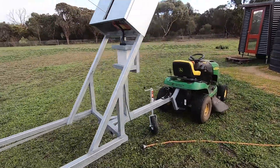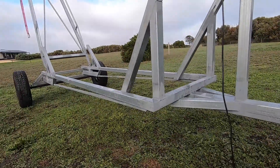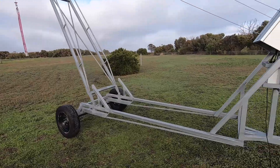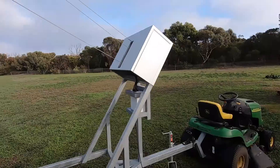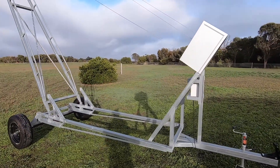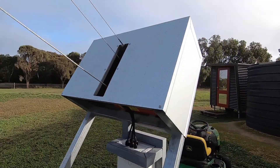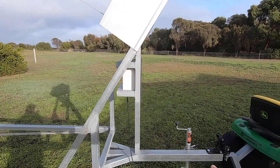The base extends back to support the winch assembly and hooks onto my counterweight. I welded up a bracket so I can use my ride-on lawn mower as a counterweight — in all my testing it's been sufficient, but for anything mildly heavy I'll use a vehicle. The crane can actually lift the boom off the ground without any counterweight, because the boom is behind the fulcrum and the winch assembly itself acts as counterweight. I've offset the winch assembly on an angle: it moves weight further from the fulcrum, keeps the winch cables pulling at roughly a perpendicular angle, and helps focus the pulling force down onto the main beam that hooks onto the counterweight.